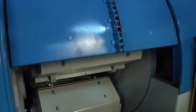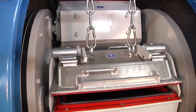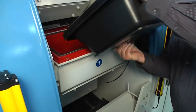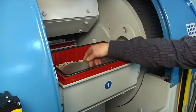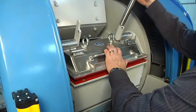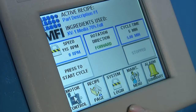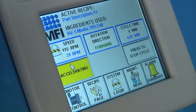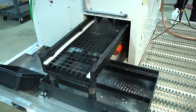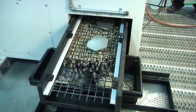Setup and operation is simple. First, open the door and remove the barrel lid. Fill your barrels with media and your parts for polishing. Secure the barrel lids and shut the door. Select your barrel speed on the programmable logic controller's touchscreen control panel and press the start cycle button to begin the finishing process. With the optional media separator, simply dump finished barrels one at a time and watch as the parts are separated from the media.